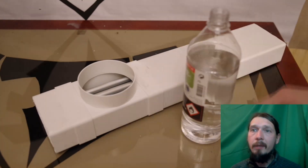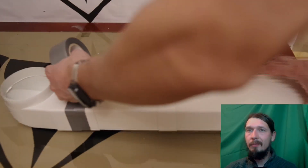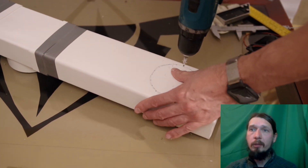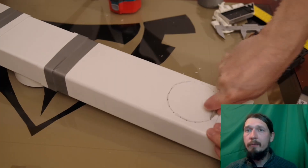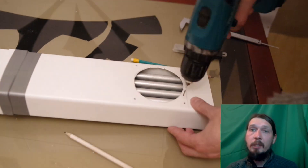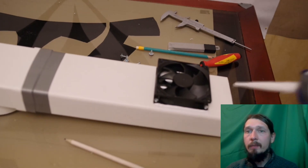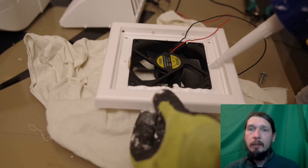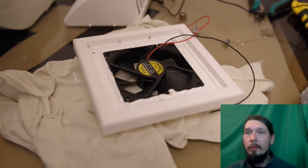There's a special PVC tape for duct joints. I didn't have white tape, so it wouldn't look great. Installing the fan — on one side I have an adapter to a round pipe. On the other side I thought it would be easy to just cut a hole in the duct itself — spoiler, it wasn't easy. I should have used an adapter to a round pipe, especially since I have a 3D printer that can make any adapter. To make it look nice I bought vent covers — the fan fits inside. A fan with a round flange fits almost perfectly. The recuperator is nearly ready.